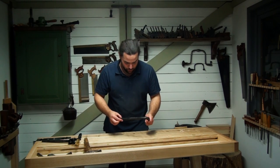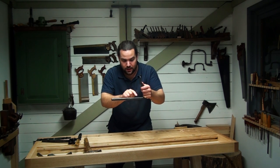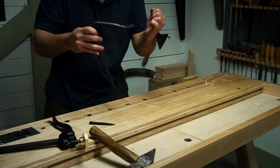To overcome this problem I've come up with a very simple solution that just involves using a centre punch. All we're going to do is texture the front of the shaft and the back. This way when it twists in the hole it will just have something to bite.